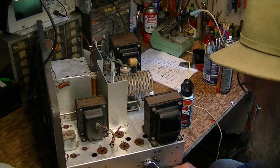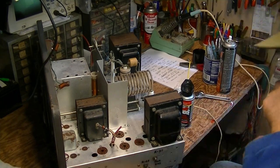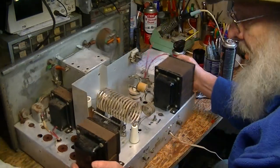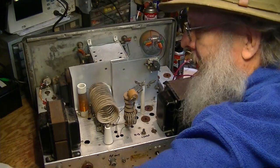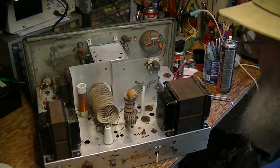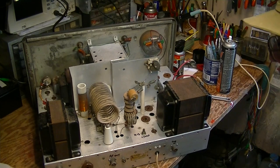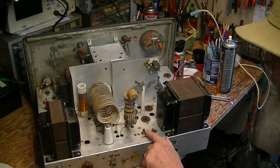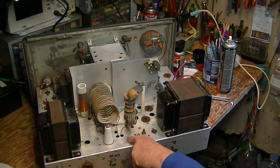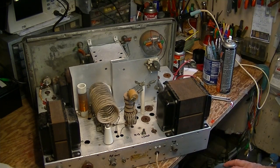This one is really stiff and continues to be stiff. Let's look at this clamper adjusting pot here. The clamper is just a little tube that biases off the final — if you lose drive, it keeps the plate current from going through the roof. So this clamper pot shaft was green, and if you look at this screw head right here, you can see it's green with corrosion. This shaft was green and that pot was frozen up.